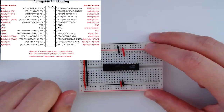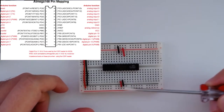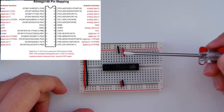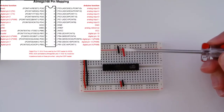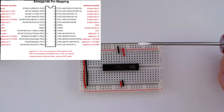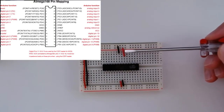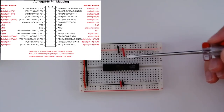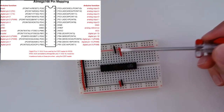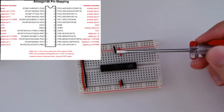If you actually want to reset it, you have to tie it to ground. Pins 7 and 8 are the power to the ATmega chip: 7 connects to plus 5 volts and 8 connects to ground. On the other side, pins 20, 21, and 22 are related to the analog-to-digital converter. Pin 20 connects to 5 volts, pin 21 is the reference voltage — I talked more about it in the previous video. We don't actually need the reference voltage right now because I'm not going to use the ADC. Pin 22 is just ground. The ADC needs a separate power supply, so that's why we have to provide something there. If you're going to use an ADC, you need to provide the plus 5 volts through a low-pass filter, but we're not using it here.